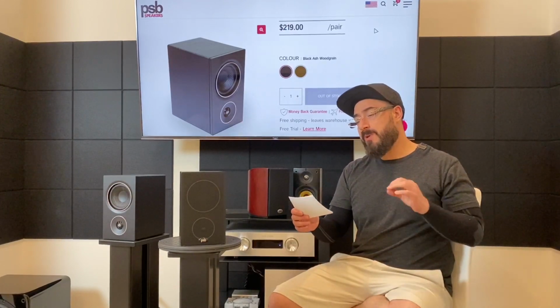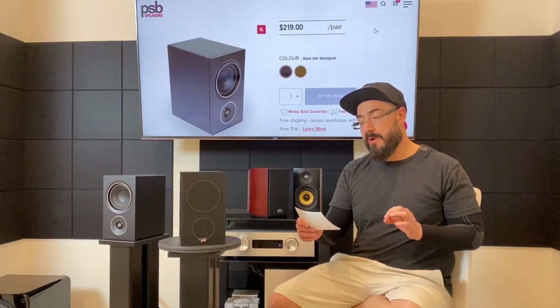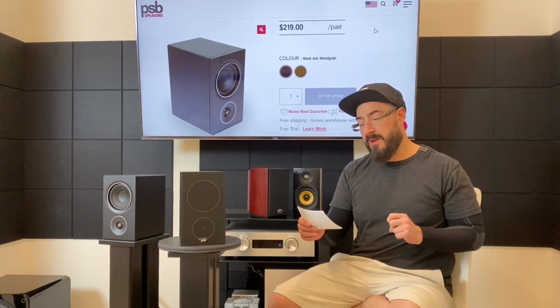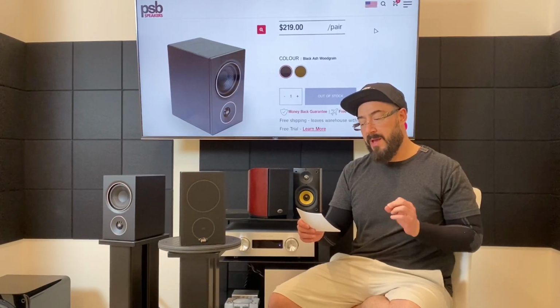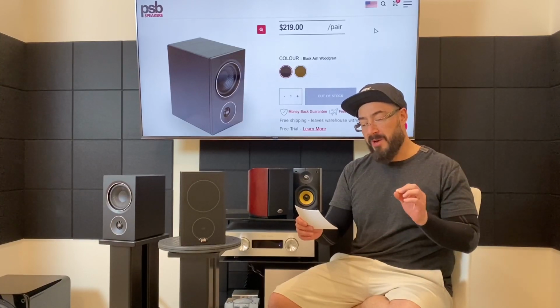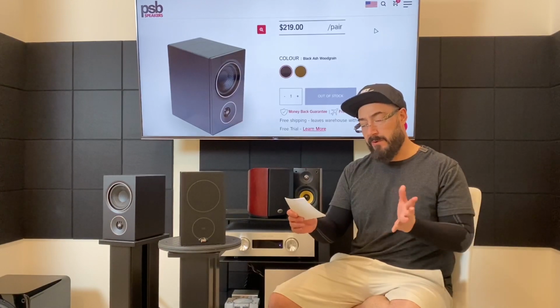Getting into it, this speaker is good for 57 hertz to 21 kilohertz, 85 decibels anechoic or 87 decibels listening room sensitivity, 8 ohm nominal or 4 ohm minimum. It's good for 10 to 80 watts. 3/4 inch aluminum dome tweeter, 4-inch polypropylene woofer. Its height, width, and depth are 8.5 by 5 by 7 inches. They weigh 4.9 pounds each. They come in black, ash, or walnut. It's a vinyl finish, of course.